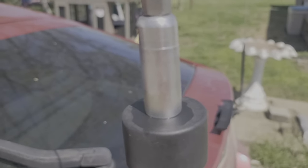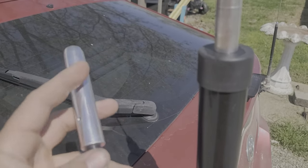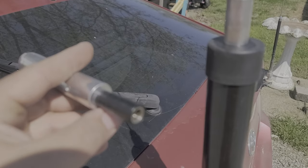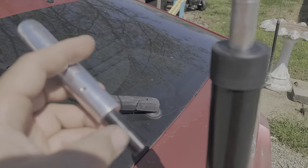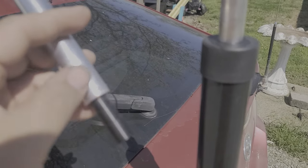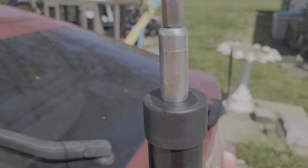Ray showed me where he had made one of these in his little machine shop. It's a telescoping base that he cut — hollow inside. You just cut your whip down enough so this slides down, put in the set screw, and it's got a 3/8-24 thread so you can put your whip on. That works great.